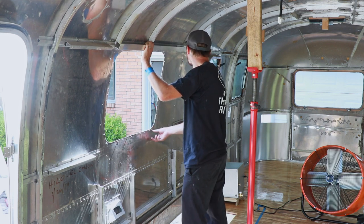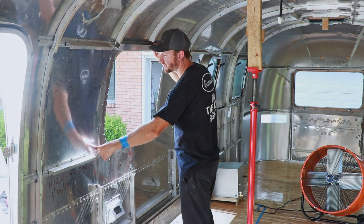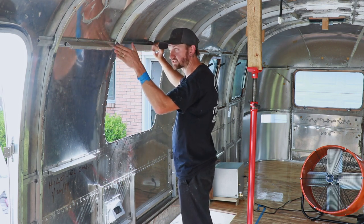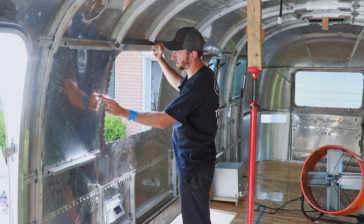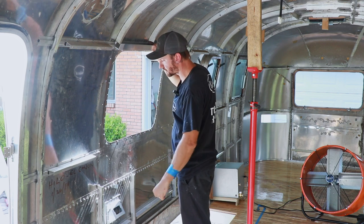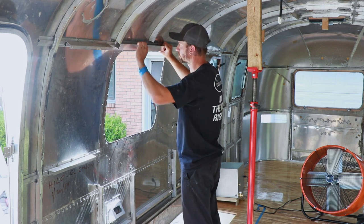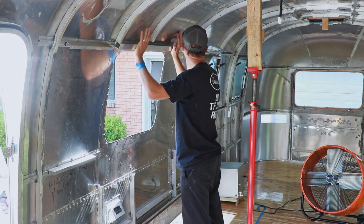Then I'm going to begin measuring and cutting the other pieces and getting them positioned in place. The top and the bottom are going to be C-channel, and for the side pieces I'm going to cut that curved piece out of a piece of eighth-inch plate, using the rib pieces as a template. Those are going to sandwich up against this, and I'm going to weld three-quarter inch bar onto those, then weld the whole thing together so it goes right in — then drill the holes to reattach the skins and build the door part. Relatively straightforward.